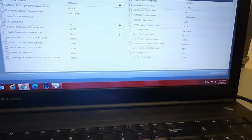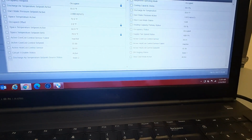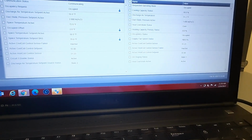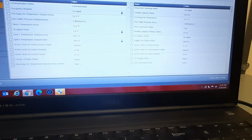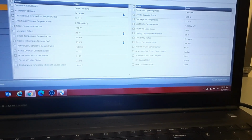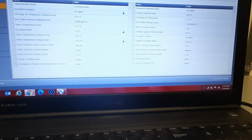After I got my static up, it was operating a whole lot better. You could tell there was an issue. When I pulled the blower door off, there was no resistance at all. I mean, it was like the blower wasn't running. So I knew something was off, and then I realized that they had the drive pulley just completely adjusted all the way out. The belt was actually riding in the threads for the adjustable part of the pulley. I made a large adjustment the last time.